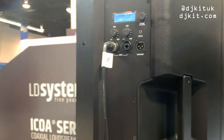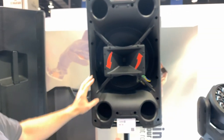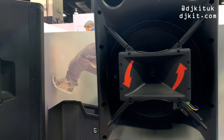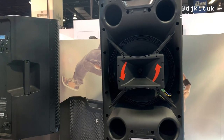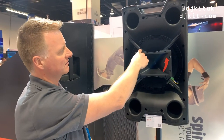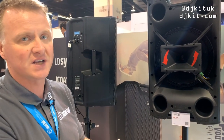The big difference about this compared to most speakers on the market: if we go to this one next to us, which has got the grill missing, you can take the grill off and you've got the possibility of changing the rotation of the horn in the middle. It's a coaxial design, so it's a central bass with four bass ports, which actually gets a little bit more bass sound out. If you want a wide dispersion as a wedge, you take this off, take these screws out, turn it around, put them back on, so you've got a really wide dispersion. Use it as a wedge — that's what you'd use it for all the time.